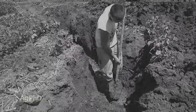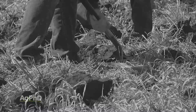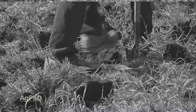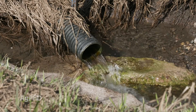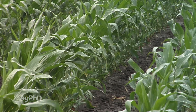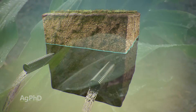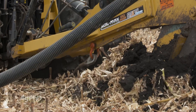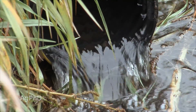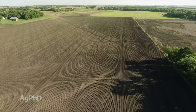Think about when they got put in — back in the Depression era, or even before that. We didn't have a lot of money, but we had lots of labor. People would hand dig down 6 or 7 feet and lay these tile lines, and since they didn't have money for tile, they put them extra deep to get more drainage coverage. The downside is that lowered the water table more. We farm in dryland South Dakota, getting only 15 or 20 inches of annual precipitation including snow, so I don't want my water table at 6 feet — or even 4 feet. I'd like it at 2.5 to 3 feet. If I set my tile lines at 3 feet, the water table in between is probably around 2.5 feet. But if I'm going to set my tile lines shallow, then I need them closer together to achieve the same drainage.